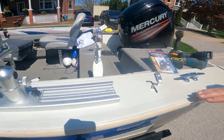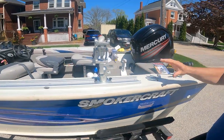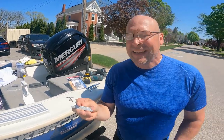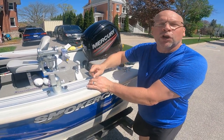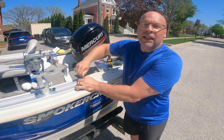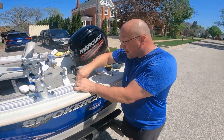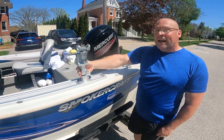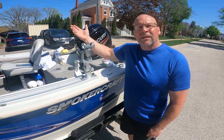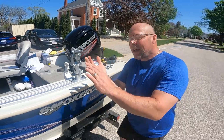This is how the tracks come — there's always an exit point for gear. You can slide them on and off either from the bow or stern. End caps are 20 bucks for a pair Canadian — this little piece fits in, you bolt it down, you're ripping down the lake and you don't lose gear. We've had two guys already this season — guys that bought GT100s and RH1s — who just rushed and didn't put the end caps on. You get in the boat, you're talking with your buddies, you throw your rod in there, and as you're ripping down the water it hits the end cap and you're fine. Without the end cap, you lose rod, reel, probably the lure, and your holder — all because you didn't put a set of end caps on.